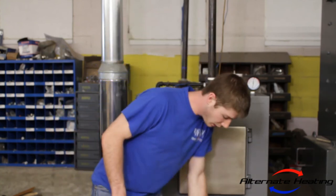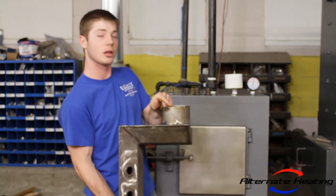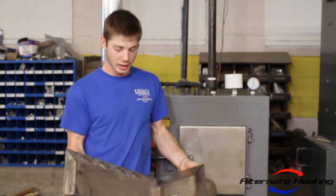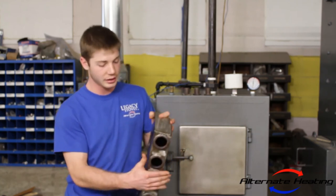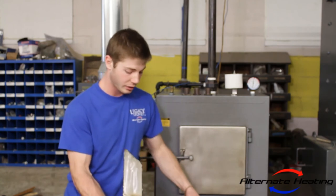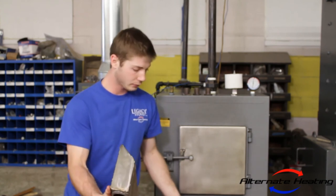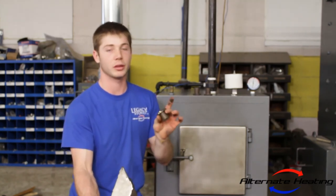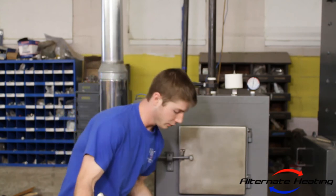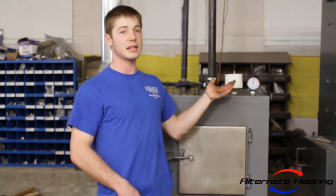The second thing is this, we call it the air diffuser. This goes in your firebox with this tube sticking in your air valve hole, and it allows the air to run through here and exit these ports here and these ports here. And this is very neat because it preheats the air and drops the air directly where it needs to be. And an added feature, it comes with these plugs to plug the top holes. So the drier the wood, the more plugs you put in. Using the air diffuser and the side tunnel plug will solve 99% of your backpuffing issues.